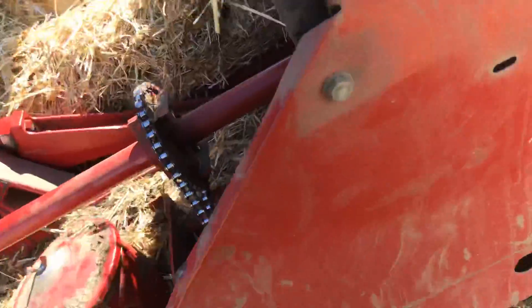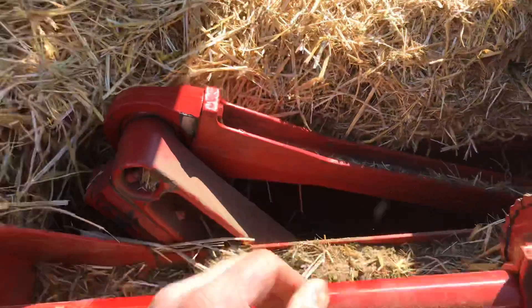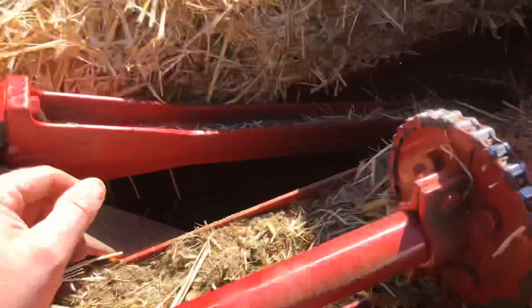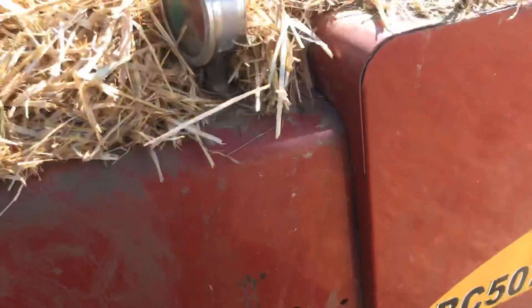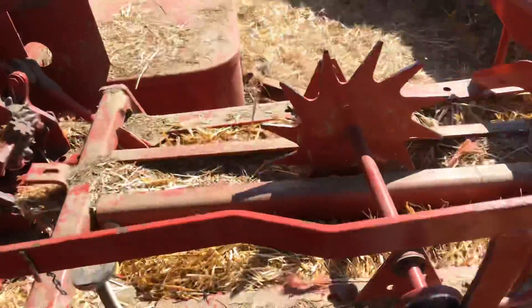Check your general chains, shake your plunger arm, and make sure there's no play in it — see that one's pretty tight. Make sure there are no obvious marks showing it's been destroyed or pounded on pretty hard. Then you get to the knotters.